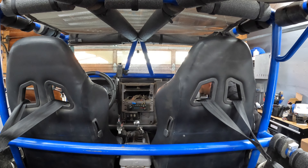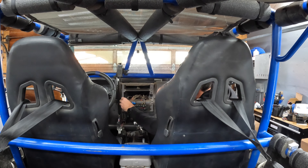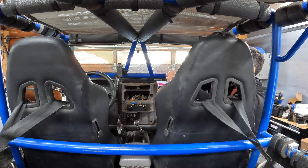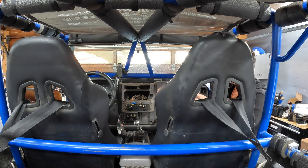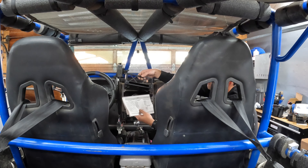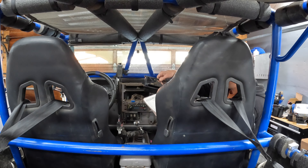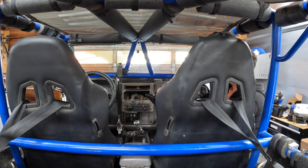Hopefully there wasn't a CD in there — if there was, I don't know what it would have been. I'll check out the adapter. This should allow for the single DIN unit. It wants me to cut and remove all the mounting tabs except for the shaded ones. As you can see, this has a lot of options on it and they're getting in the way, so I'll go ahead and cut those off with some side cutters.